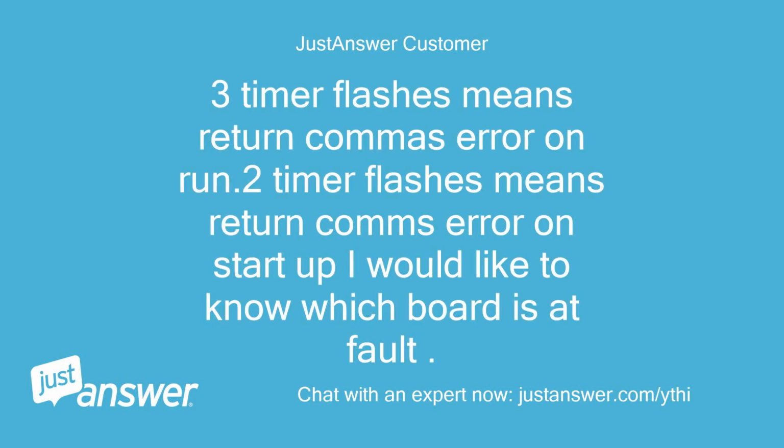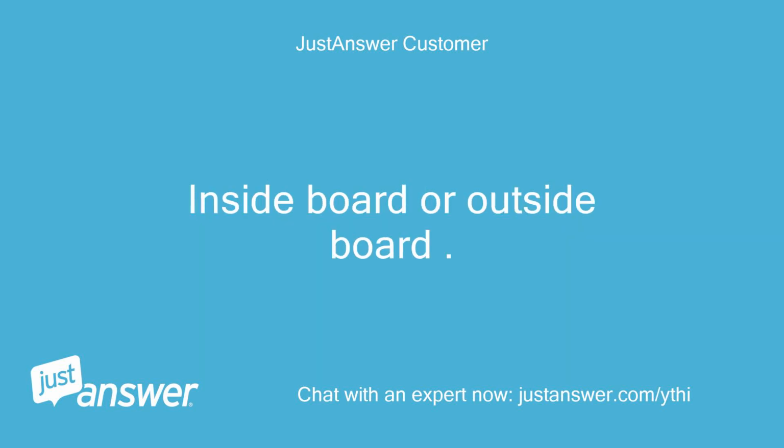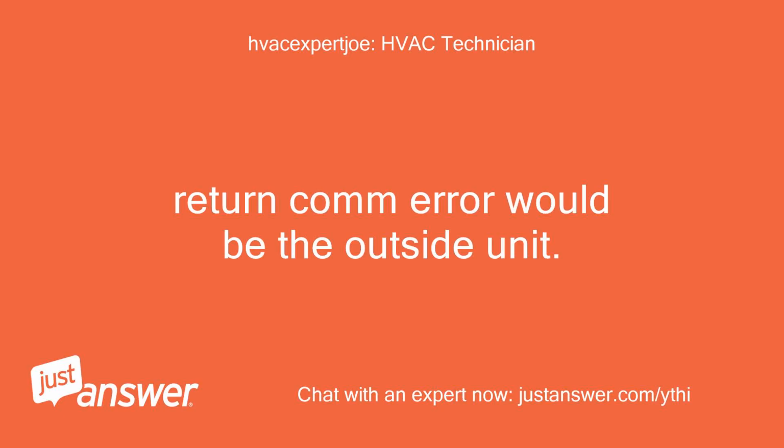3 timer flashes means return comms error on run. 2 timer flashes means return comms error on startup. I would like to know which board is at fault. Inside board or outside board? Return comm error would be the outside unit.